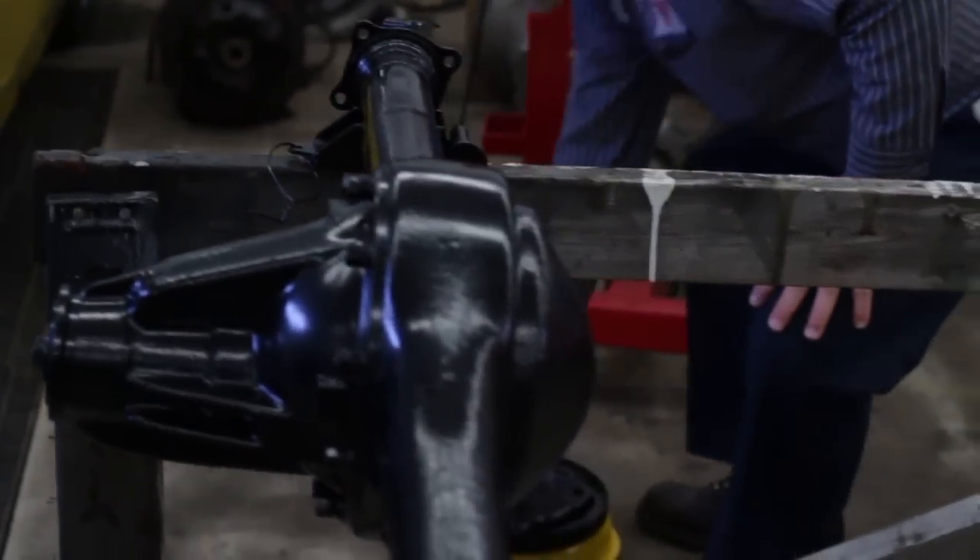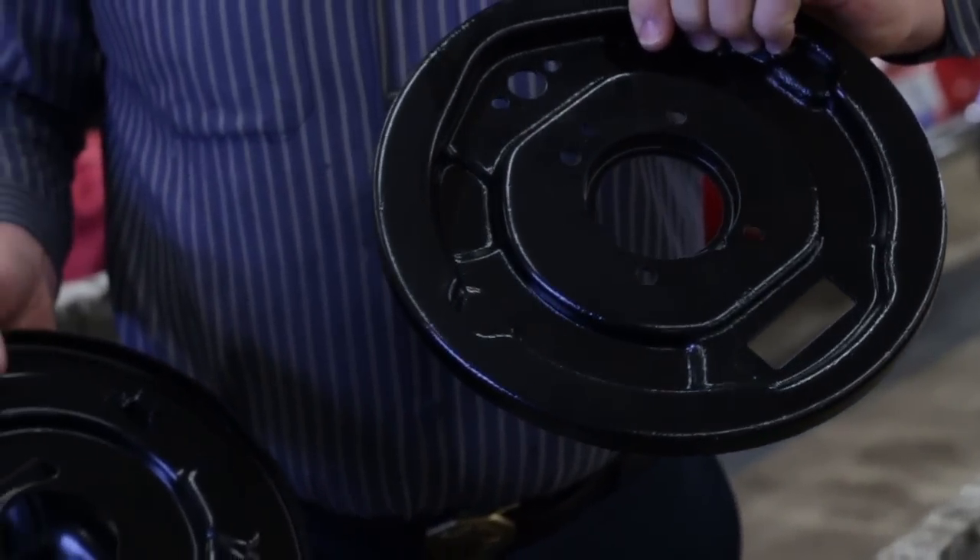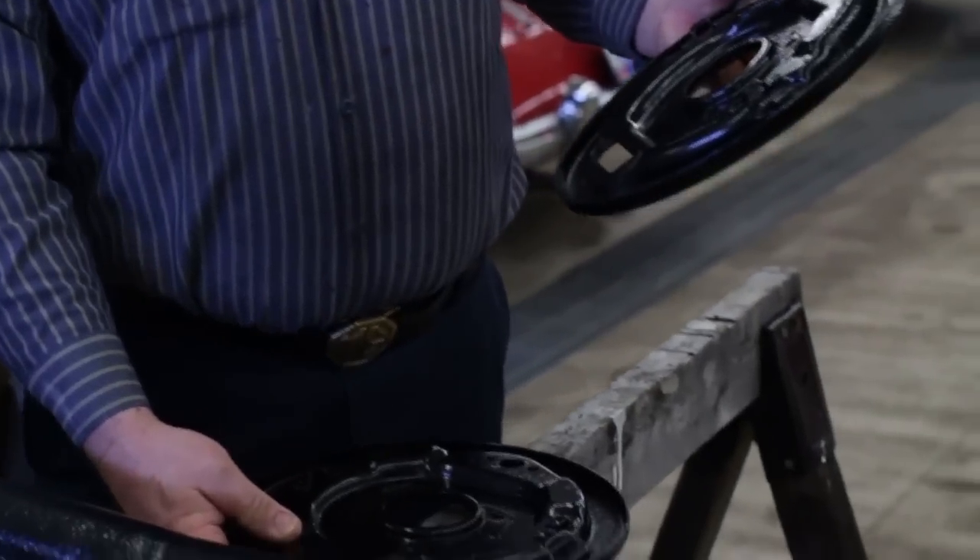Here we've got the backing plates, all powder coated. Powder coating is fantastic — ultimately they're all just coatings; paint companies now sell coatings instead of paint. Powder coating is paint, but it's dried differently: the metal is sandblasted, a static charge is applied, the powder adheres to the metal, then it's baked at around 400 degrees, melting the coating so it becomes one with that sandblasted surface. It's an expensive way to do restoration, but it's the greatest way.